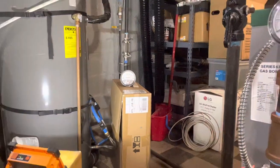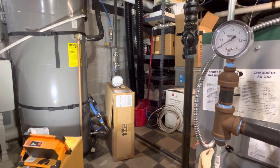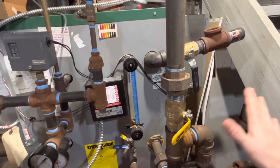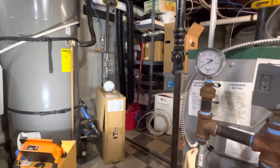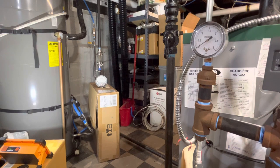All right? But the reason I'm running this second experiment is a couple people on the heatinghelp.com Steam forum asked me, well, what do you think it would be like if you had your valve turned off the entire time, from a cold start up through a heating cycle and then to cool down? One person thought there might be a water hammer that would occur, and another person thought that the water levels and the pressures in the boiler might do some strange things.